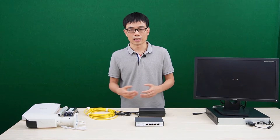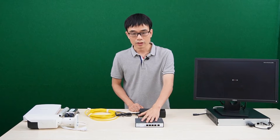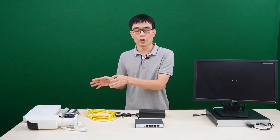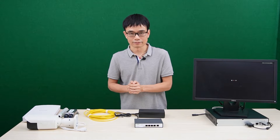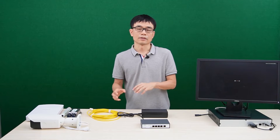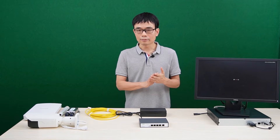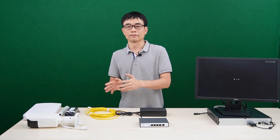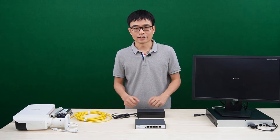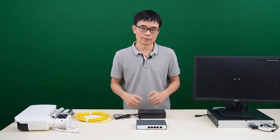There are new applications such as PoE LED lighting — it's a very interesting area. We can use this PoE switch to send 90W high power to a PoE LED controller, which then distributes power to different LED fixtures. More importantly, once we connect the LEDs to the network, they can integrate with building automation. For example, if there is a fire alarm, we can set the LEDs to light up and guide people to the nearest exit. Other areas such as NAS (network attached storage), access control, and industrial control also require high power and can take advantage of the PoE++ switch.